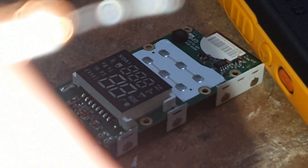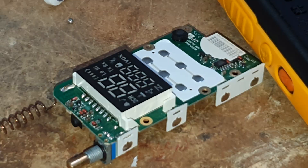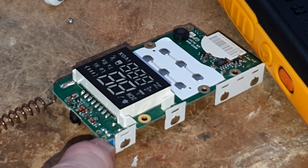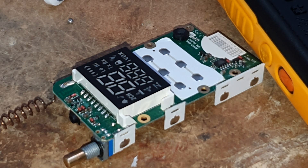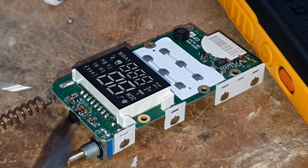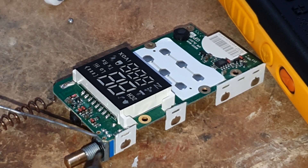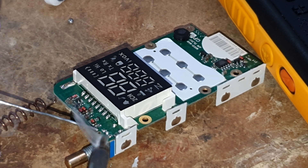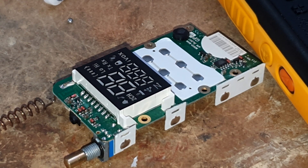What I've done here now is I've got a single strand of wire — I'm just going to use that to make the bridge. But first, what I'm going to do is just put a bit of solder on this ground point, and that just makes things easier. I could just put a solder blob across there and it'll work, but this just is a little bit nicer and looks a little bit better.